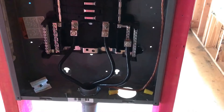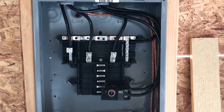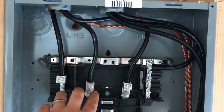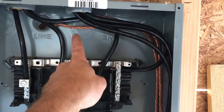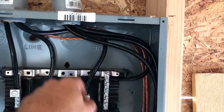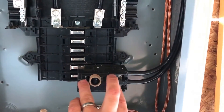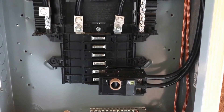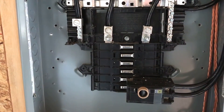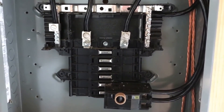Time to run downstairs. I'll have to test again to get that other circuit, figure out which one's my neutral, and get it wired up, and then I'll be done with all this sub-panel wiring. Box number two — which is technically box number one in the system — got it wired up. So you can see my main leads come in from the main panel outside: neutral, hot, hot, of course ground is copper, and then this neutral coming in — this is the neutral going back out to the upstairs panel, and my two hots from the upstairs panel are tied in with this 125-amp double-pole breaker. So this is essentially the main breaker for the panel upstairs, and subsequently for this panel, there'll be another 125-amp double-pole in the breaker panel outside. So I'm going to go get the outside box wired up, and then maybe I can call the power company and have them come tie in permanent at some point.